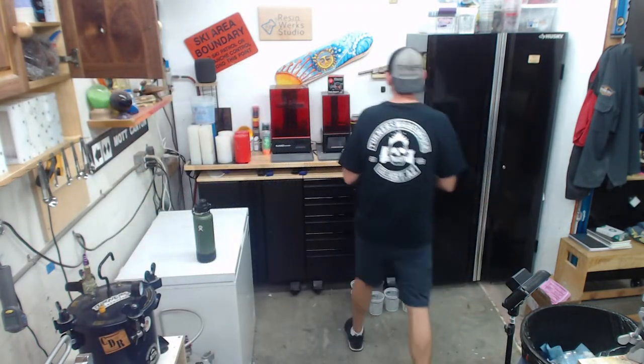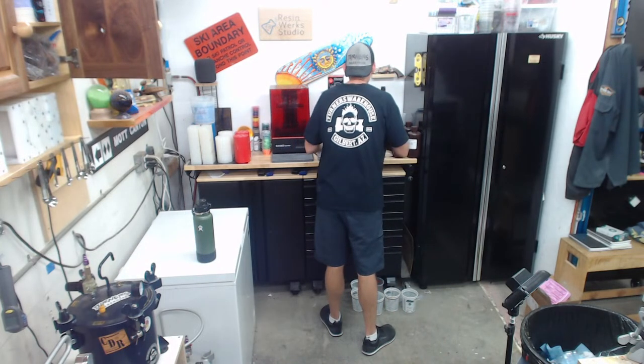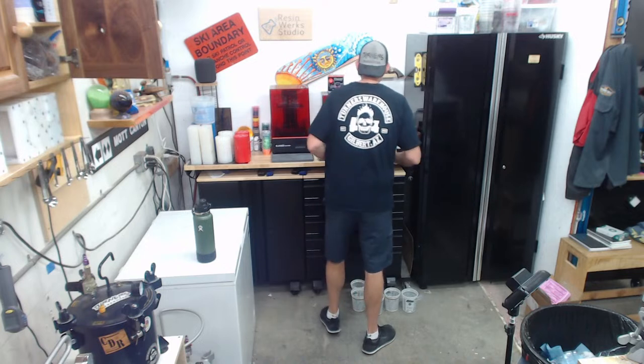The resin that we used, like I said, it was a longer working time resin, about 45 minutes, something like that. Maybe 30, well, I don't know how long that stayed open, actually. Quite a while. Now we're gonna go for Alumilite Clear and just see how that works. Now, I don't necessarily advise that you use Alumilite Clear with this thing, but I want to try it. So we're going to make a coaster out of Alumilite Clear.